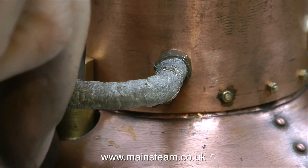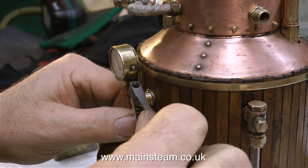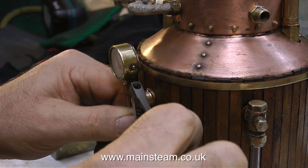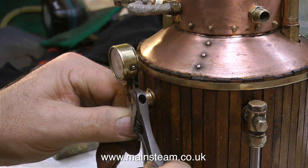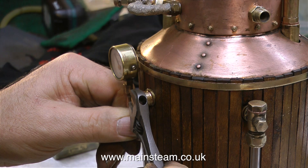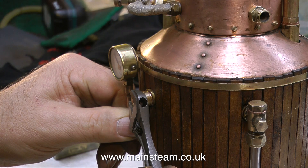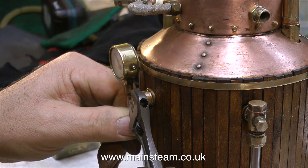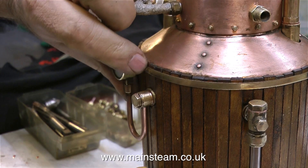This clip is showing the fitting of the piece of insulated pipe between the steam tap and the superheater input. I do know that this is not really a superheater. On a steam boiler, generally speaking, the superheater tubes go through a large fire tube — oddly enough called a superheater flue — and some of them even protrude into the fire. These are very good superheaters and the steam is extremely hot. Proper superheat is only suitable for cast iron cylinders — you'd do a lot of damage to a gunmetal cylinder with severe superheat. I'm actually aware that these small model boilers are not superheaters but steam dryers. But to avoid confusion, I will continue to call them superheaters.